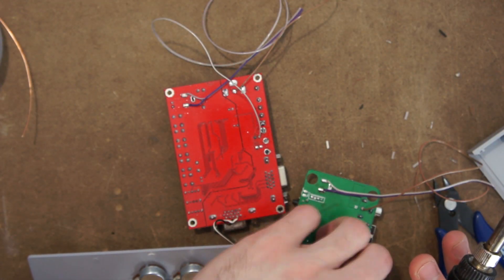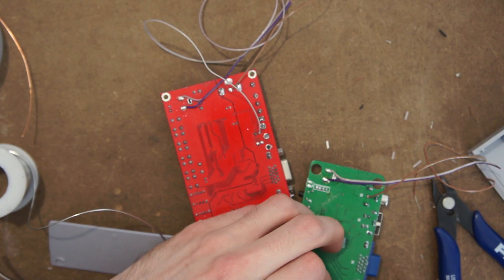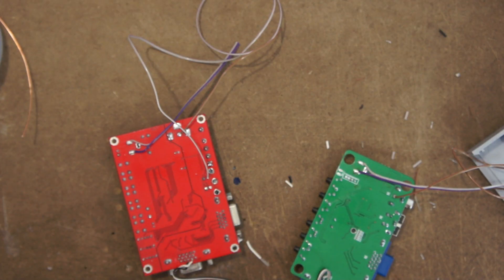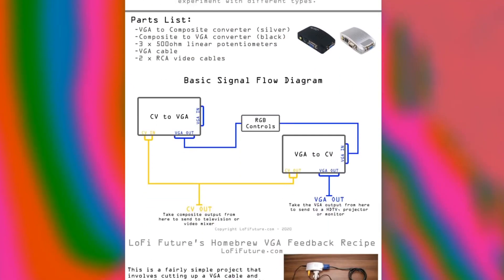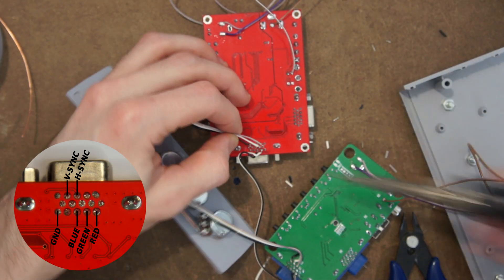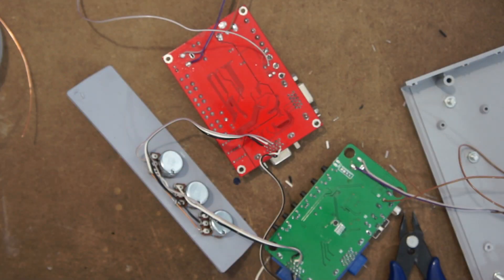Now it's just a matter of soldering up all of the internal wiring harness. First we'll start with the video signals and power, and then last we will solder in all of the bend points that run to the SDRAM chip. I won't go into too much detail on the wiring process here — instead I'll provide detailed wiring diagrams that provide plenty of information on how to get this done, including the points on where to solder on VGA connectors. For those who know my original VGA converter video synth tutorial, I used to recommend using the included VGA cables, but now I'd just recommend soldering directly to the boards, as the cables you often get don't really adhere to any set colour code, so it's really hard finding which wire is which. This will solve a lot of confusion, and anybody that's been having trouble with that project should find this really helpful.